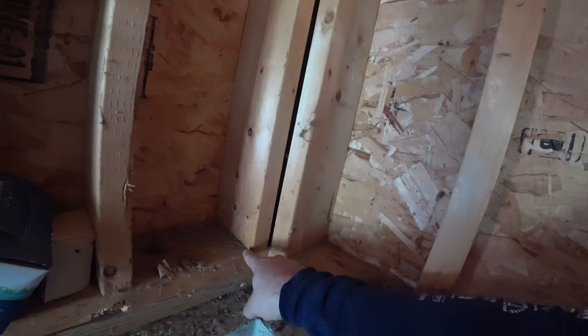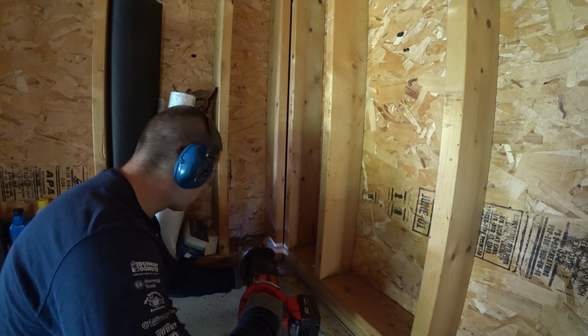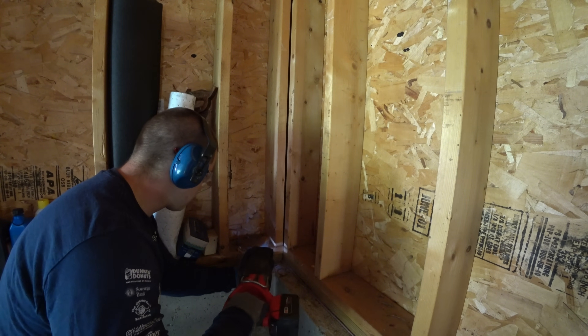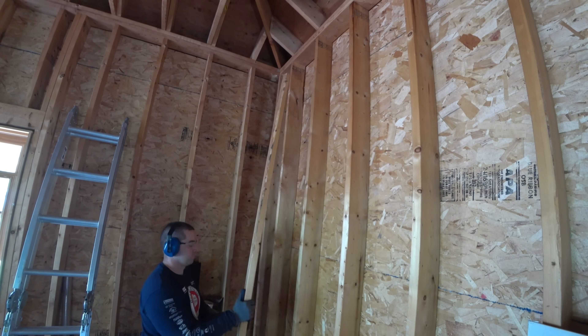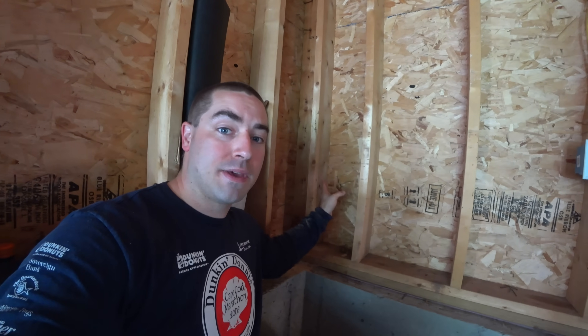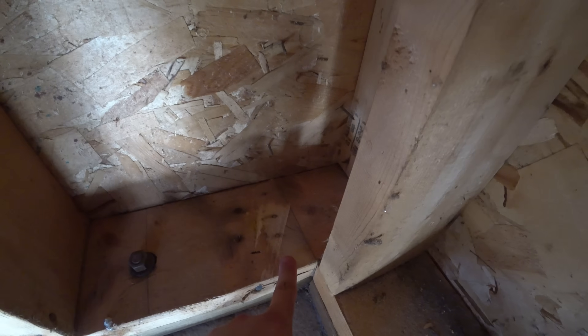So I'm going to cut the nails that are in the bottom and the top. You can see how this one is not fastened to the sheathing. My theory is: why would you want to spend any time or money doing a job that's only going to work 50%? Because that's what you're giving up if you don't get these tiny details — a tiny percentage of space missed contributes to a huge chunk of energy loss. It's not a linear scale. With that corner vacuumed out, you can clearly see where the stud sat and the nails I cut with the reciprocating saw.